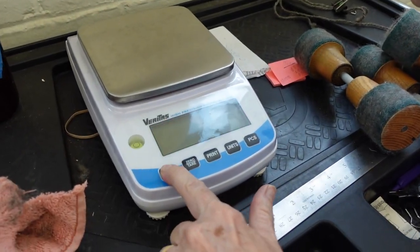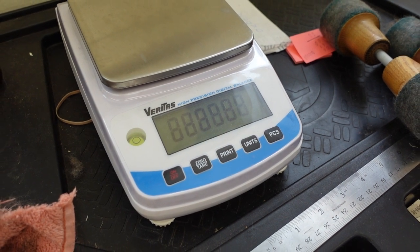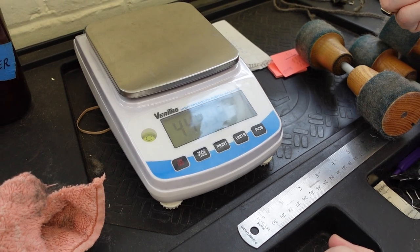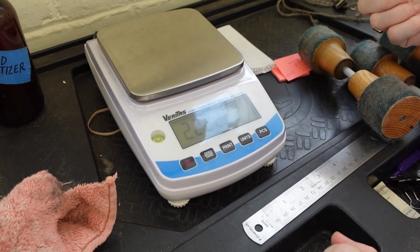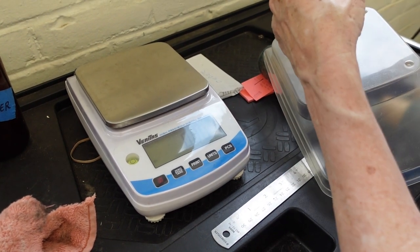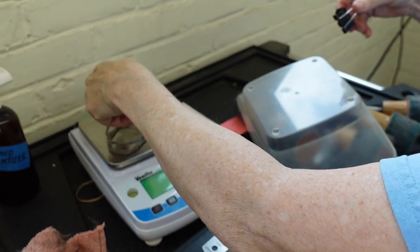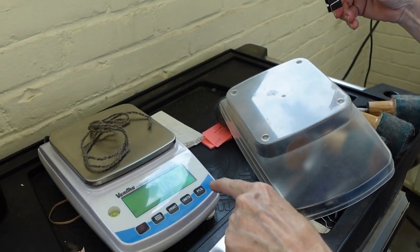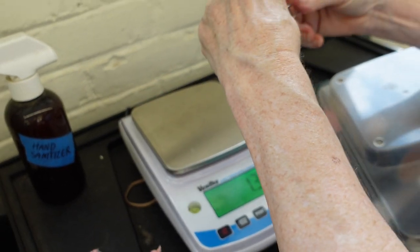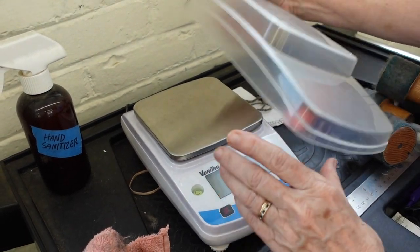And this is our scale that we'll measure in very, very sensitive calibration. I'll do an example. I have a little piece. This is not 2 yards. This is for me to figure out, see how you can see it's very sensitive to how it's weighing that little piece of yarn. So you do the test, you weigh it, you adjust your back roller.